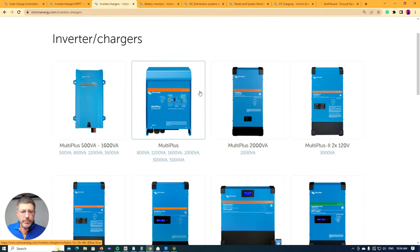Now we'll jump over to the inverter chargers. I personally don't recommend plain inverters. For the cost of an extra couple of hundred dollars, I'd highly recommend using an inverter charger. With just an inverter and a separate charger, all the charger does is charge the batteries. With an inverter charger, the generator powers the loads first and any surplus goes back to charge the batteries, so you get full use of the generator. I'd highly recommend always using an inverter charger — they're a much better device.